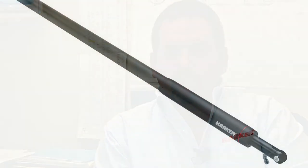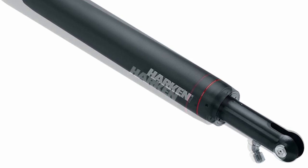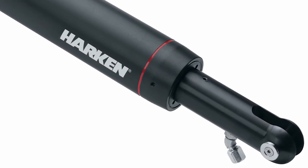We have a complete line of boom vangs in a variety of styles. We do a single-acting standard air return boom vang — these work with hydraulic pressure pulling the vang down, and air pressure pushing the boom back up.